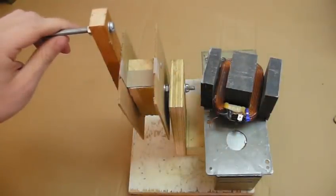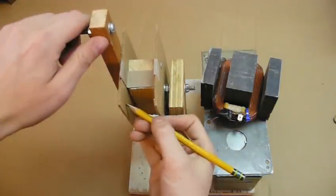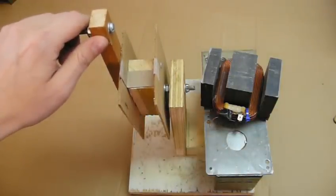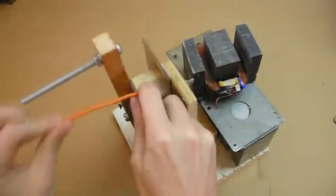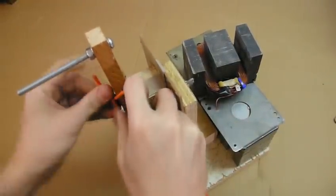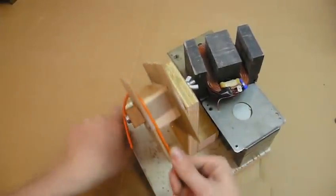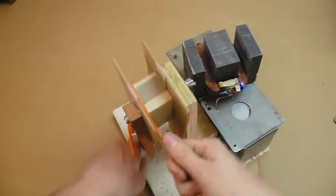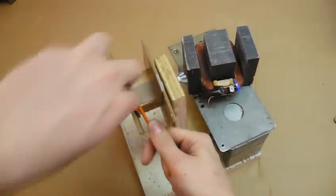If your project doesn't have an exact voltage and thereby turns target, mark on your bobbin where the edge of the core will be so you'll know where you'll have to stop. Add a notch or a screw and wrap the wire on it to anchor it, and begin wrapping from the outside. For thicker wire, counterintuitively make sure you kink each wire at the corner outward with your thumb before it passes through the core again so that it lays flat.